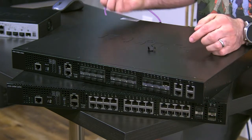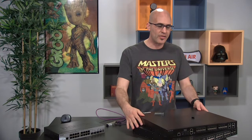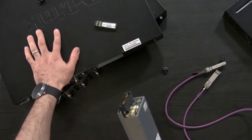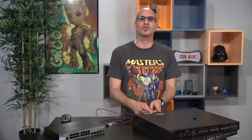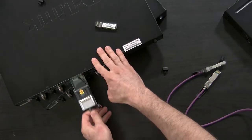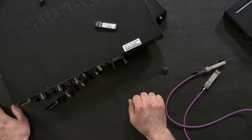In an AV over IP world, also bear in mind what encoders you're using — whether they use SFP connectors for long-distance fiber runs or copper connectors like Cat 6 or Cat 7. Now one thing I really like about these DXS switches compared to the DGS is replaceable parts on the backside. It comes with one power supply that is hot-swappable, and you can add a second one for true redundancy. If this is the backbone to your AV matrix or your editorial environment, you definitely want that second power supply. They've also got replaceable fan cartridges so you can swap out fans in a dusty environment and keep the network switch running cleanly.